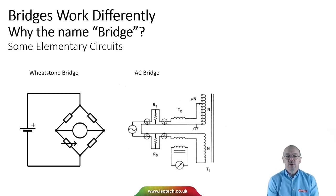So why are they called bridges? Traditionally it was a Wheatstone bridge which was used, but Wheatstone bridges aren't really used in thermometry. AC bridges became very popular and the circuit is slightly different — but these are the elementary circuits of this bridge which allow the ratio measurement.